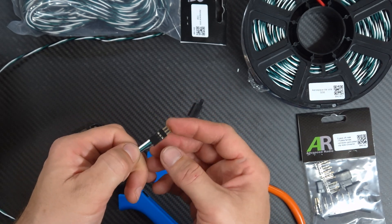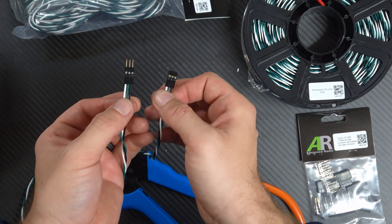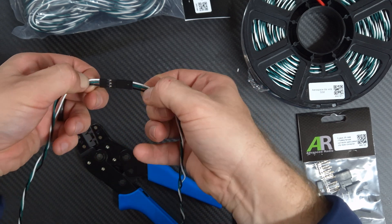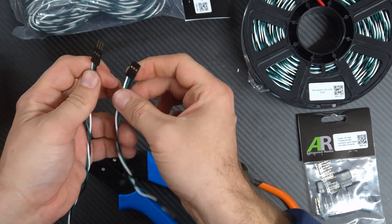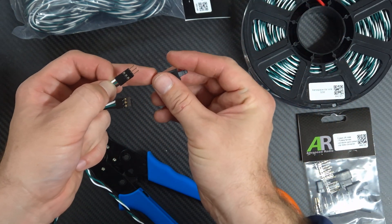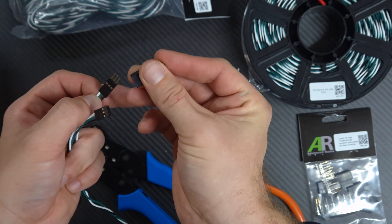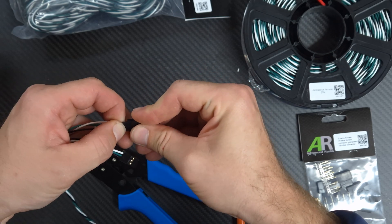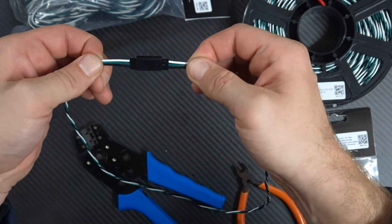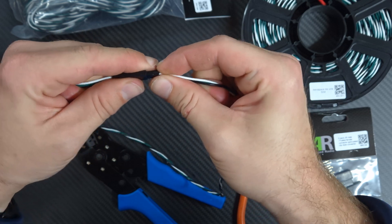Now all three of our crimps are in the housing. For the male side, you'll notice it looks almost identical to our female side. If I rotate them around, you'll get the connection lining up — white to white, green to green, black to black. It's always a good way to double check. The next step to turn this into a standard male connection: we grab our housing here, you can see I've got the notch there and the clip is facing out. It will just slide straight on and go click — that's holding it in place. Now connecting these two up, that little clip holds around over the top and makes a good connection. I can disconnect it just like that.